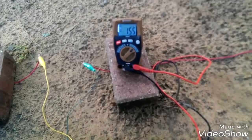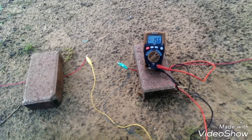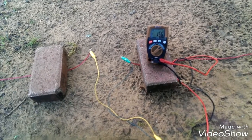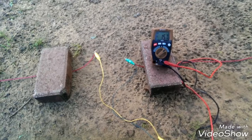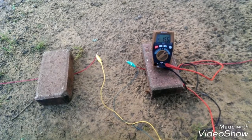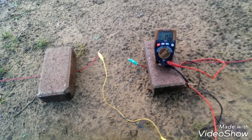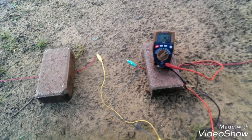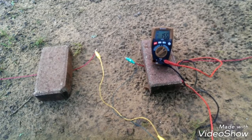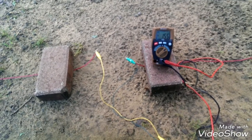At 7:30, I'm showing negative 15.5 millivolts. Now you guys are going to get different readings. It just jumped to 15.6, but I'm going to go with 15.5 and record that. Yesterday we had a pretty good rain and this ground is damp. I've noticed over the years of reading that after a rain or during a rain, it's just going to basically short out your readings — you're not going to read a thing. Rain ruined many a good day of fluctuating readings.